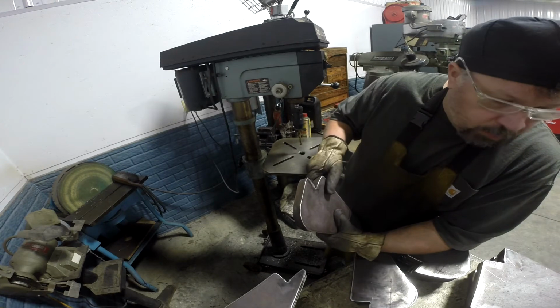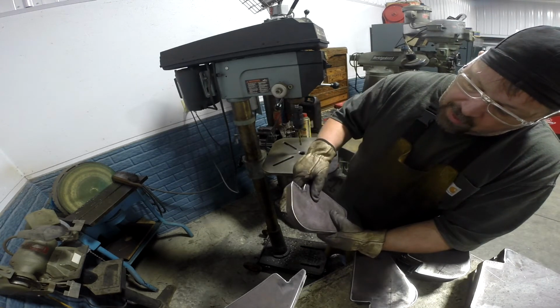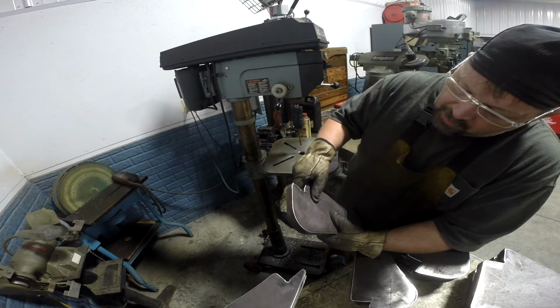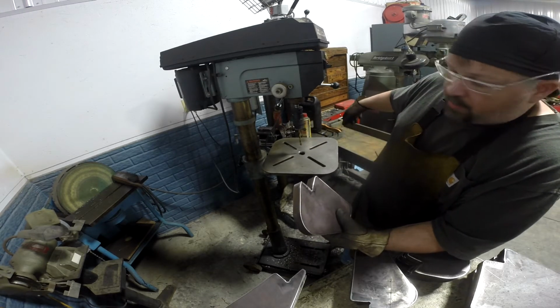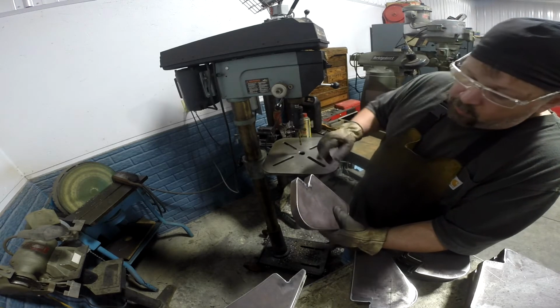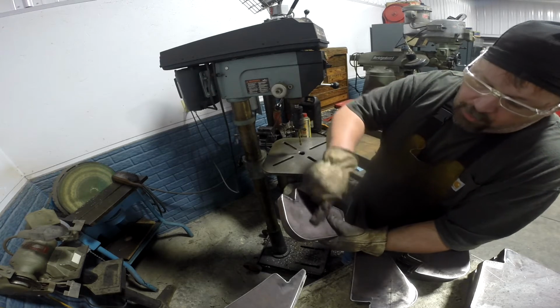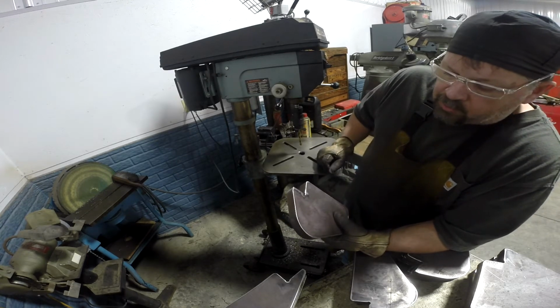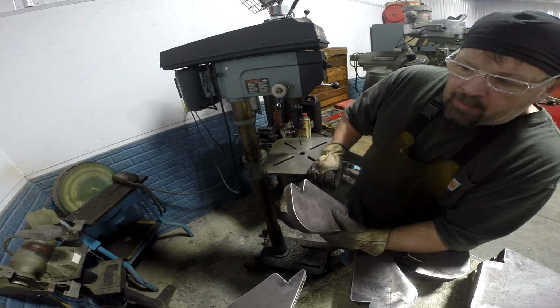So we've got 24 times 2, 48 holes to drill. These outside 2 will be 5/16, and we'll drill them all. I'll transfer them all to their cart, and then we'll change over to a chamfering bit. We'll chamfer the holes and get them ready to tap, get them back on this cart, and then we'll go do this hole. Let's get them started. I'll drill a couple, and then we'll change over to time lapse again.